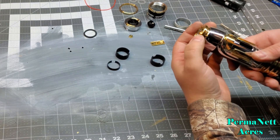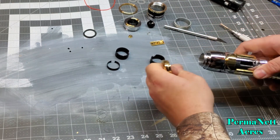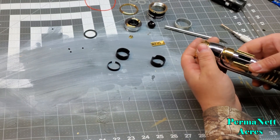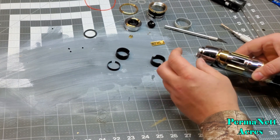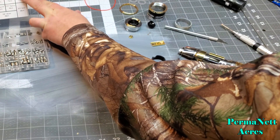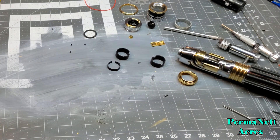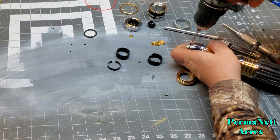I'm going to end up drilling out one of these holes for a blade retention screw. Right now I need to check where one of these marks is right here. I got some 6-32 screws — I'm looking at either a 1/4 or 3/16 inch 6-32 Allen screw.